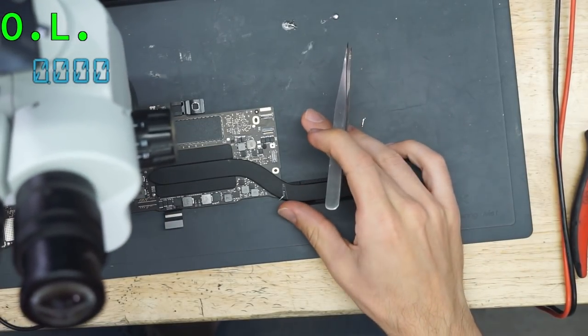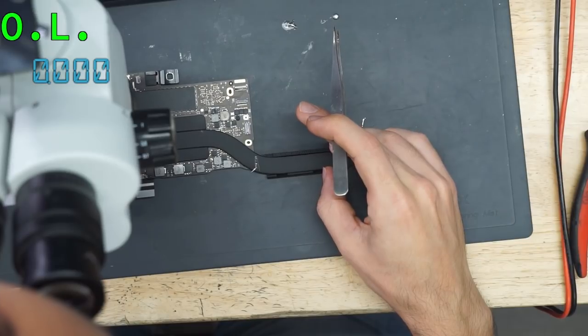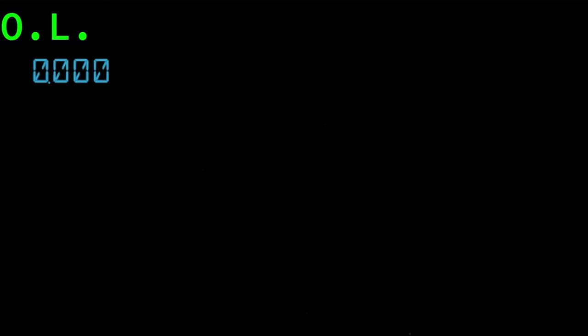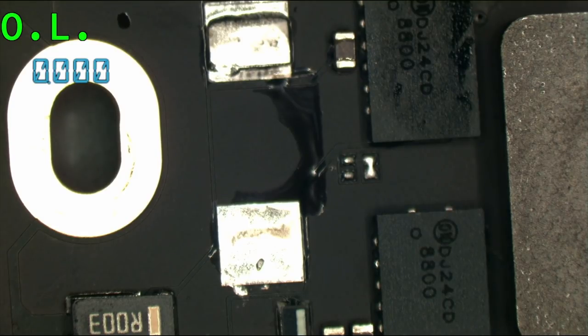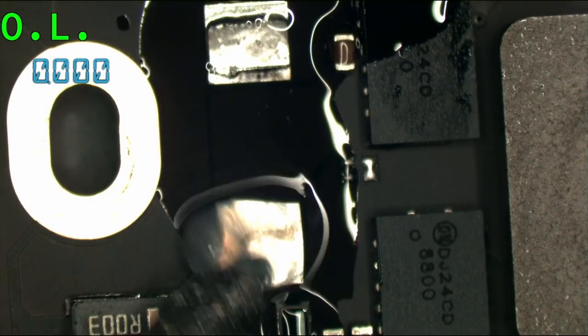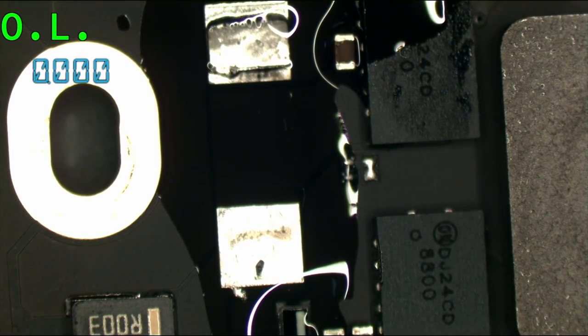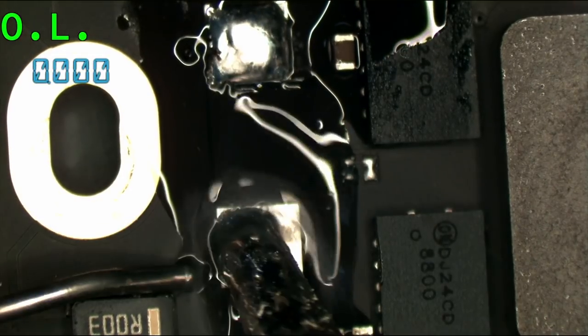It's only going to take as much amperage as is requested, but a short to ground is going to request as many amps as possible. A short to ground is greedy. It's kind of like Mr. Clinton with greenies. Mr. Clinton will never stop requesting more greenies. It doesn't matter how many you give him, he will always demand more, and he will loudly scream and try to bite your hand off in the pursuit of more greenies. The same way that a short to ground is always going to want to consume more amperage. If you give electricity a pathway to ground, it is not going to limit itself unless you limit it with a resistive load between it and ground. And if it sees a pathway to ground, it's going to take that path, and it's going to take as much power to ground as it possibly can.